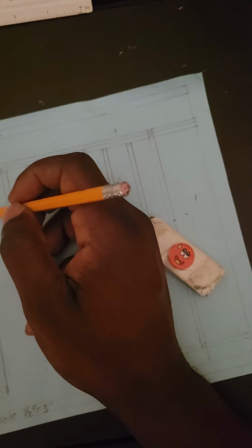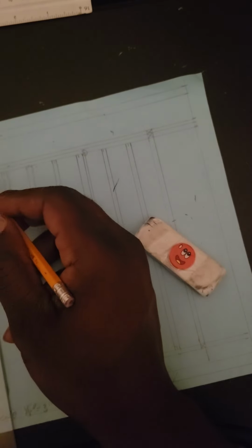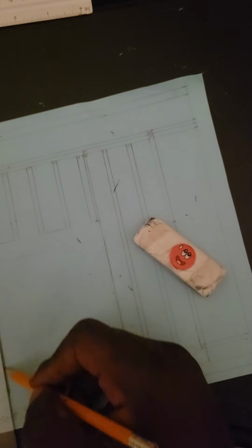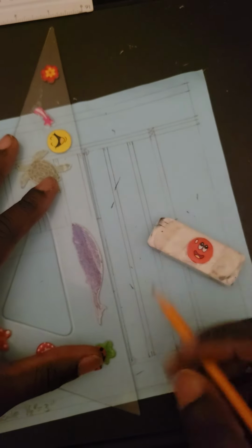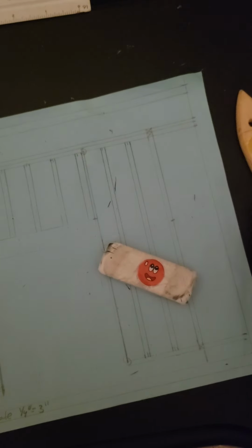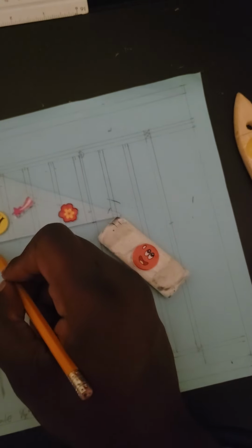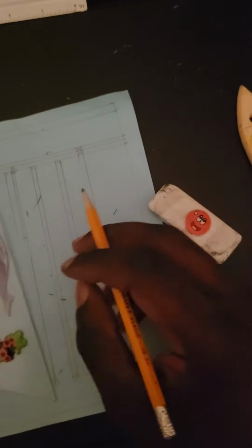So what you can do, you can actually move it over, just in case you want to break there on that, and then put an extra 2x4 on there. Sandwich it next to it so we have some more backing, just in case they have to break on it. Let's just make that a double. Sandwich those two together. So double 2x4 there. Now your top cripple there.